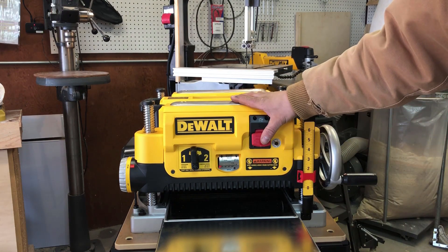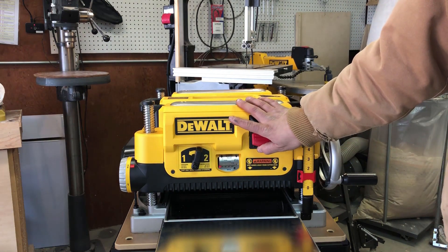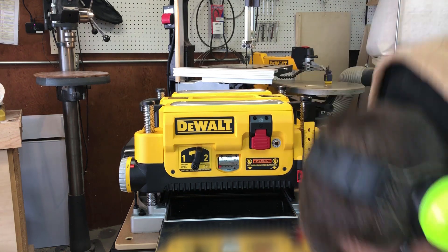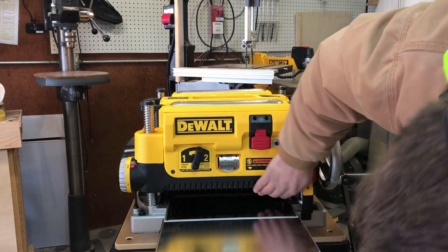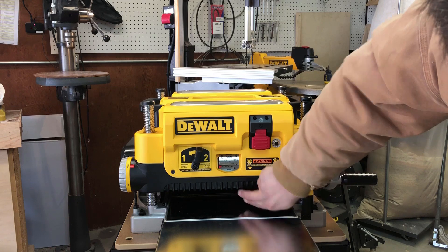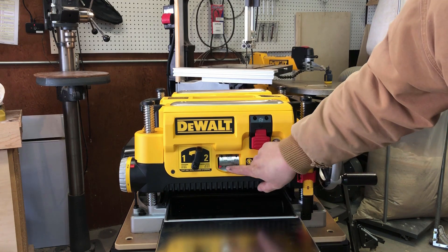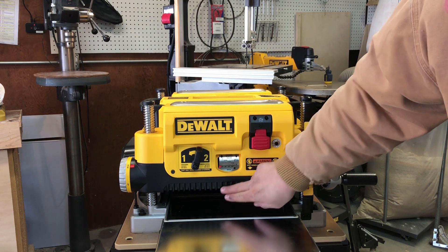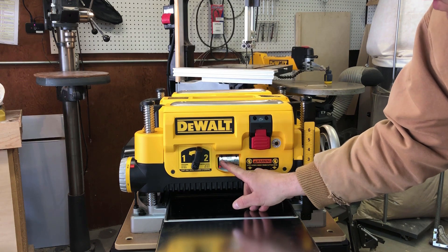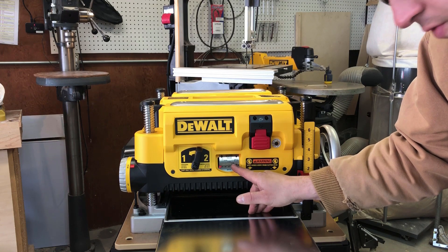Turning it off now. We'll go to the high speed mode and see if it sounds a lot higher. Sounds just about the same to me. Now I'm going to unplug the tool and show you right down here — there is a removal gauge. It tells you how much you can remove. When you put your board in here, it'll raise it up just a little bit and give you an idea of the maximum amount you want to take off. That correlates to the width of the board — it's measuring how wide the board is. Because if it's a 13 inch board, which is the full width of this unit, you don't want to take an eighth of an inch off — that's a lot for this machine to handle. That's why it recommends that for a 13 inch board, you only take one thirty-second of an inch off at a time.